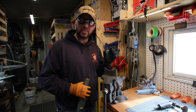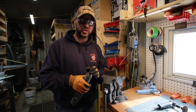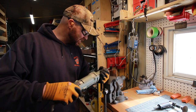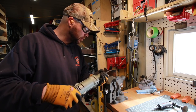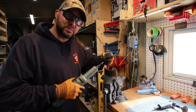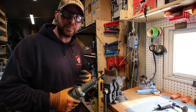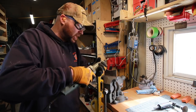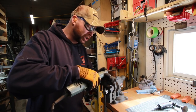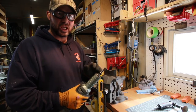I've got a piece of 3/16th mild steel plate here and I'm going to show you how well this thing cuts. One thing to keep in mind when using rotary burrs — you want to make sure you've always got a little bit of clearance around the tool. If you try cutting a straight line down into the material, there's not enough clearance around the tool for the cut material to eject, and it'll bind and start a really nasty violent vibration. Once it happens to you, you know exactly what happened — it shakes your hands and busts off the teeth of your cutter, so really want to avoid that. Always make sure when you're cutting you're keeping a little bit of clearance and not capturing the cutter within the diameter of the cut itself. Also, gloves are a very good idea. Hearing protection is a must, and safety glasses are critical.